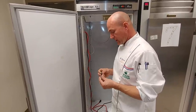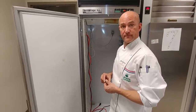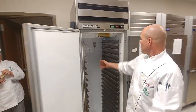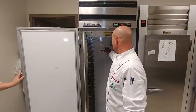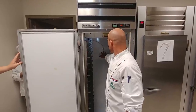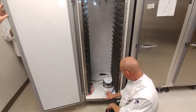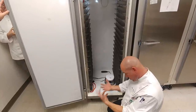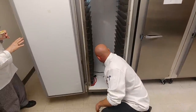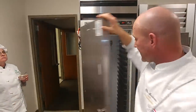We'll come back tomorrow, and if it's holding, we're going to start filling this meat locker. Stay tuned for other Shasta College culinary how-to's. Now our fridge is complete. We've mounted the sensor for the atmospheric controller, put all of our racks back in, and all the cords are tucked away behind the racks and secured so they don't get wrapped up in anything. We have our humidifier full of water ready to go — you just turn it all the way on because your atmospheric controller is going to take control of it. It is plugged into the extension cord that goes directly to the atmospheric controller, and the other extension cord is just available power for the small fan we need to add. That would be the last step — the small fan.